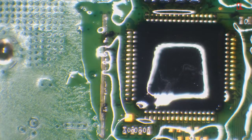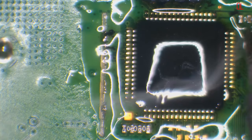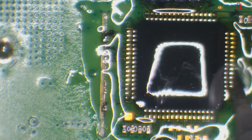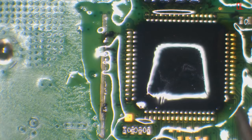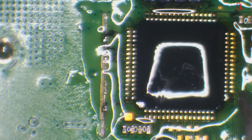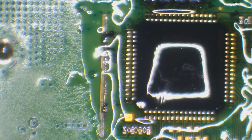Well, this one, for example. Let me just make sure there's enough solder on these. Look at that. See how much just came off and went back onto the iron? What's the hottest thing? Me. Clean the tip, do it again, and done. And that's cleaned the bridges. Beautiful. Right, let's clean this up.